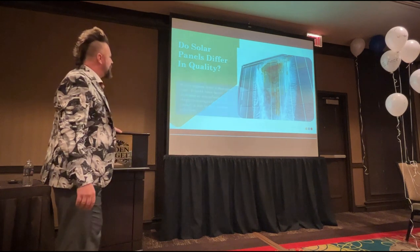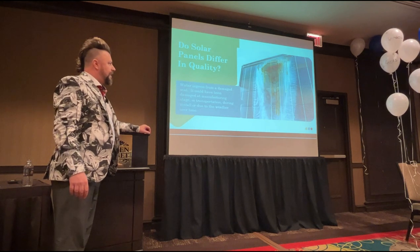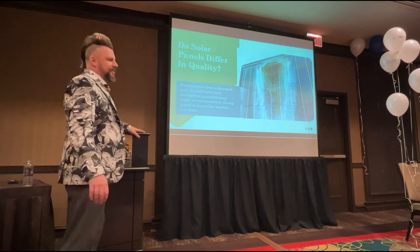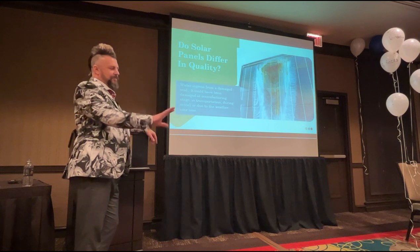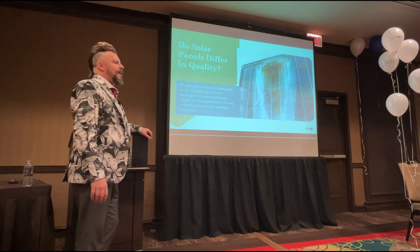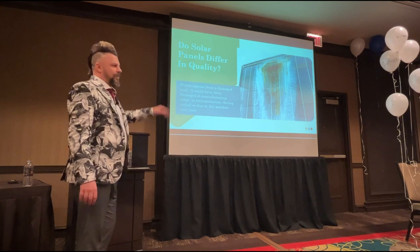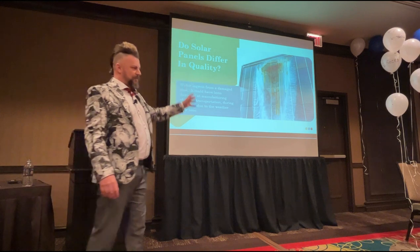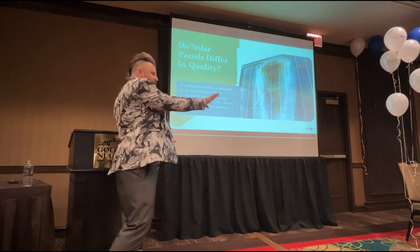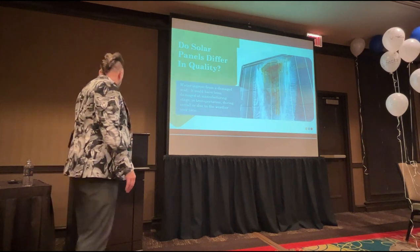So what's got in there? Can you still clean it? Water ingress. I wouldn't touch that, no. You won't touch it? No. Any brown that we see on solar panels, sometimes you get splodges of brown and things like that, we just photograph it, goes in our report. Dear customer, we didn't clean that one because you've got an issue going on there. So makes sense. We just wouldn't clean that one in that instance, yeah. Because we can see clearly that's an individual panel fault. The reason that we wouldn't clean the perimeter panels is because they're all strung together. So I don't know if I'm going to spray some water on there if it's going to react with the one that's next to it. But in this instance, I'm not going to worry about that.